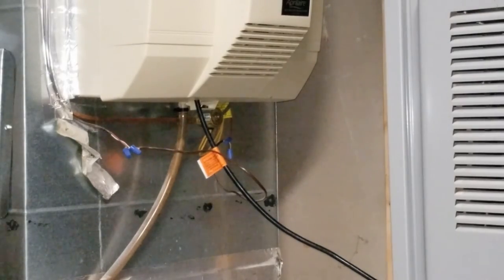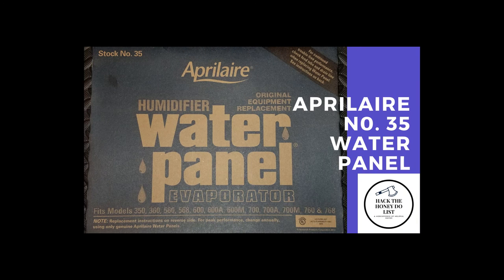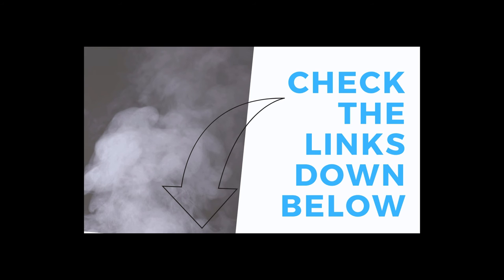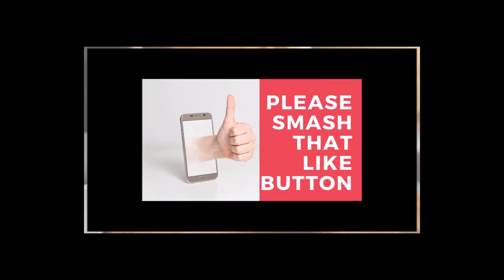There you have it — we're done. If you have any questions, put them in the comments below. Smash the like button and I will get back to the comments and answer any questions. It's fairly self-explanatory. You can get the water panel — I will post a link below this video. If you have a Honeywell or other brands, there are whole house humidifiers mounted on your ductwork on either the supply or return that have the flow-through type water panel like what we're doing, and it's pretty much the same process. The back of the water panel has directions on it, and you can find it on AprilAire's website as well. I'll put links to the water panel below — you can get it much cheaper than having somebody come to your house to service this. It will save you a lot of money, and it's easy to do. You should do it every season. Thanks, take care.